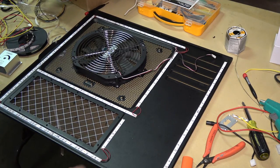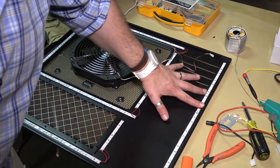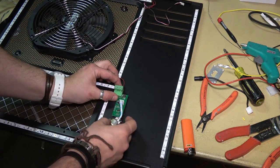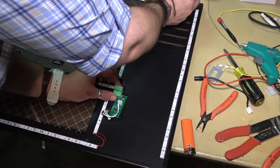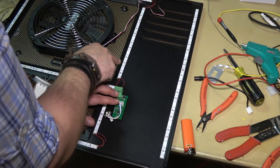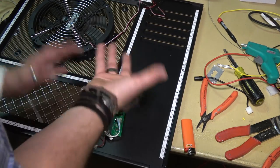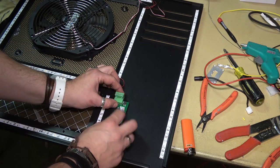I've done all the connections — this strip connects to this to this to that, so they're all in the circuit. I haven't connected this last one yet. I'm thinking about hot-gluing the dimmer PCB to the door, drilling a hole through for the pot to stick through. We'll run power wires down to the molex, and power out from the dimmer to the LED strips. Since everything is connected, the 12 volts just needs to make contact with one strip and it'll feed all the others.